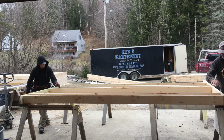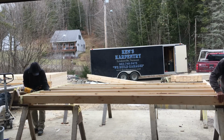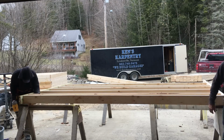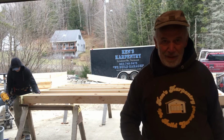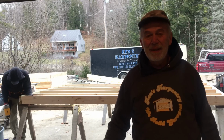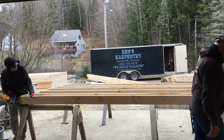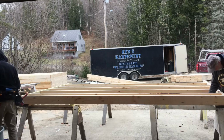When we nail lumber, I always go with what I call the 6-inch rule. Stay a minimum of 6 inches away from where you're nailing, because you can do it like this. And yeah, I had told somebody once that was working for me, make sure you stay 6 inches away. He's like, no, I'm good. And so I turn around, I'm going to do something, all of a sudden, bang, and ow! Off to the ER. Just takes a second.